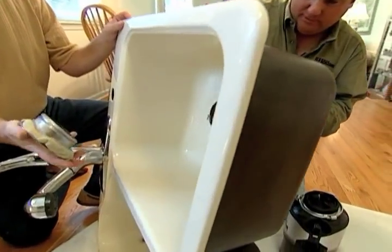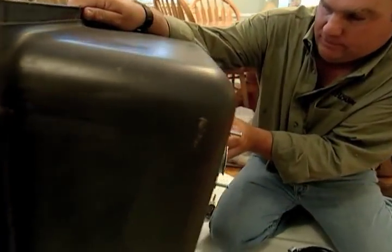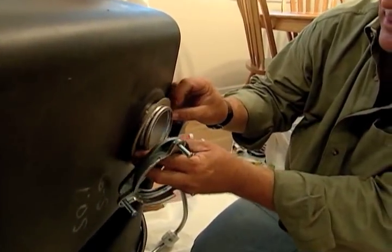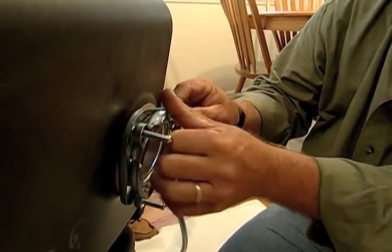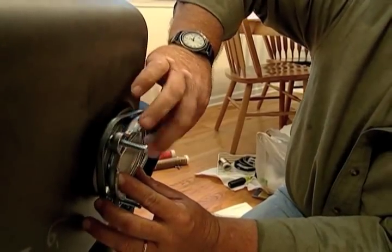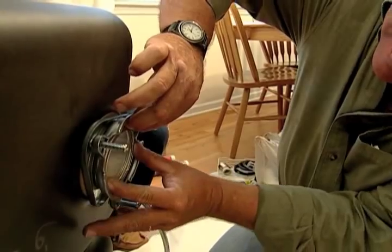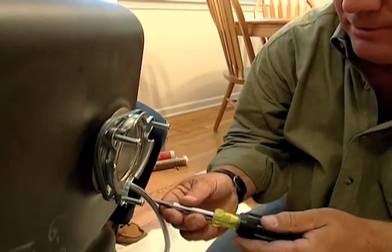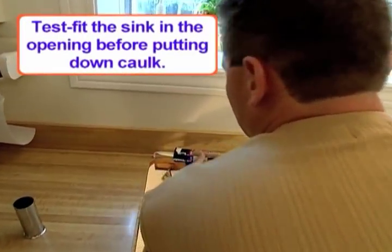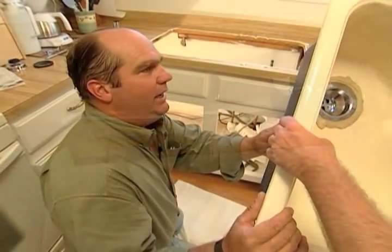Push it through from that side and hold back against the sink. Give it a push. Now there's a batting order on this side — a series of rings: first, second, third, and last is a snap ring. Once I get that back against me — there's the snap — and now I tighten up these screws and cinch it up, keeping it right near the edge.